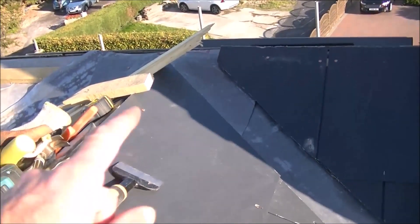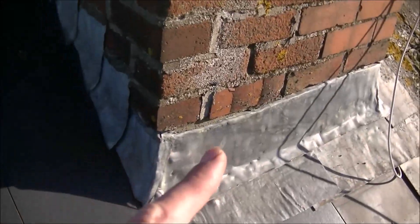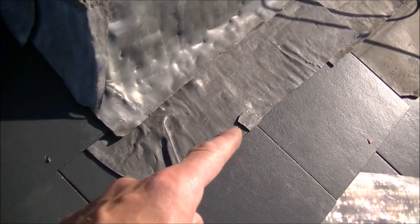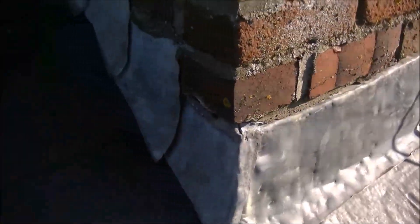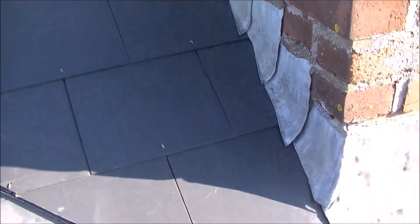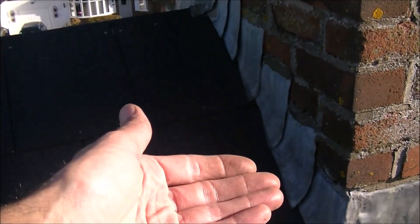There we go, that's done — took long enough. Anyway, you've got your lead valley down there, going nicely, shooting off. I'm going to trim that lead when I'm finished, but I'll leave it like that until I finish the roof. I've put the final old bit of lead back over the top — you can see that other sort of lead apron underneath. I had to use a little lead strap on that, just for belt and braces. There are a few nails in the bottom but I don't always trust that with the weight of it. I've tied it into next door's and used the old lead flashing over the top, tapped a few bits to hold them in place. I'm going to come back when the roof's done and put in some roofing sealant rather than mortar — it's a bit more flexible. Finally, the lead soakers you saw me putting in are all out of sight, but they're what really keep it dry — they turn up the wall and come out, and each bit of lead throws the water onto the next slate, and so on.